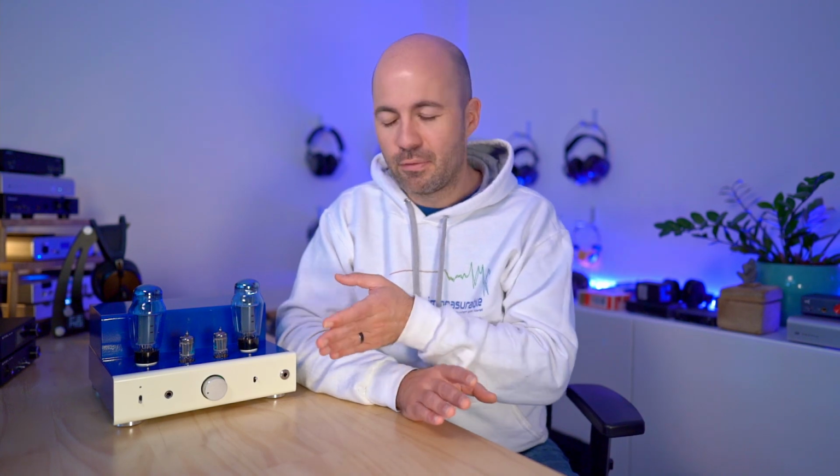So at this point, if I didn't have this socket on the front, what I would have had is a fantastic sounding speaker amp with incredible transparency, incredible detail, lots of speed and snap in the transients, but one that still sounded pretty mediocre through the headphone socket. And that's because of the resistor network that's used to produce the power coming through the headphone socket. But at the same time, adding a huge output impedance that just kills the ability of the 8200R to work with anything below about 300 ohms. And ideally, you really want to be even higher still.